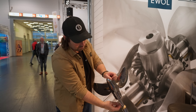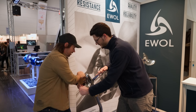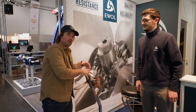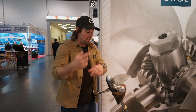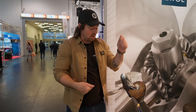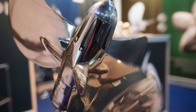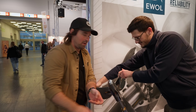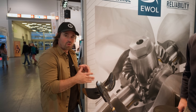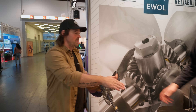The prop is also very, very thin, which gives even less drag. The wonderful thing about this one is it has a regen position. When it goes into reverse, it stays in that position, meaning the pitch is perfectly set up for hydro generation. So it lets you spin that motor for generation all the time — no hydraulics or electronics required. You simply put it in forward for propulsion, then in reverse it flips into the regen pitch and you can hydro generate as well as go backwards. The water pressure that flips it is really amazing to see.